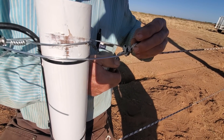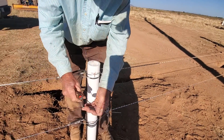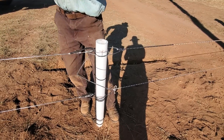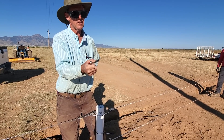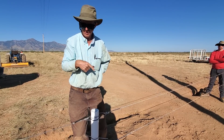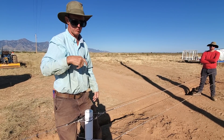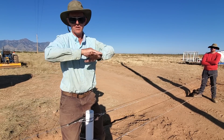There we go. This wire was left intentionally long so that when I hook on here to go to the road, it will be clamped right onto my other wire so the feeder wire comes in at this point and electrifies this whole thing. The fencer we have has an electronic control where you can reach out, touch this wire, and hit off — it'll turn the power off to the whole farm. Otherwise this would be a great place to put a switch. That's the beauty of having a controller with an on/off switch — it sends a signal back to the power box and the whole farm goes dead.